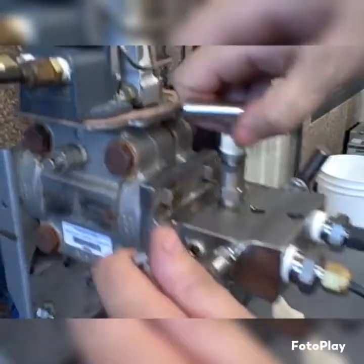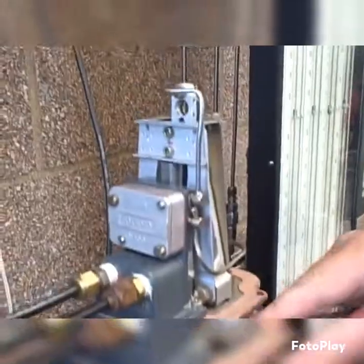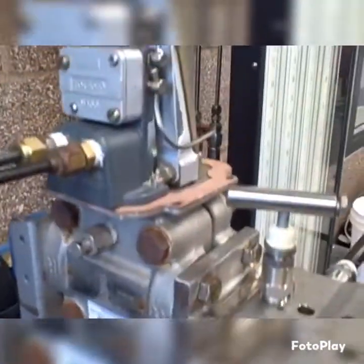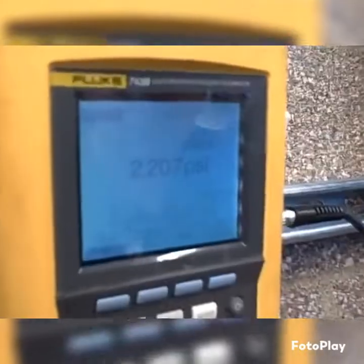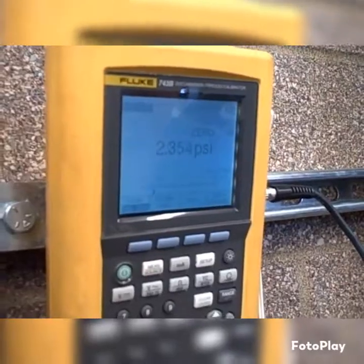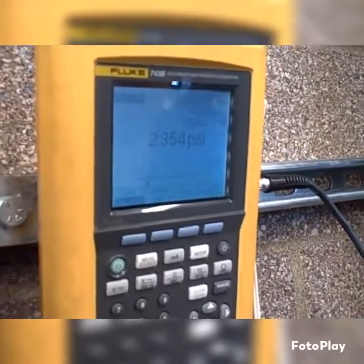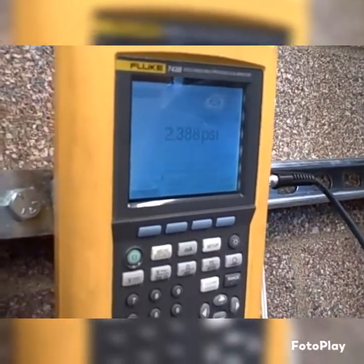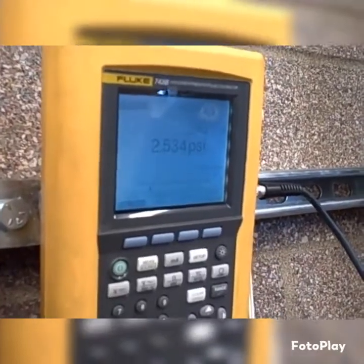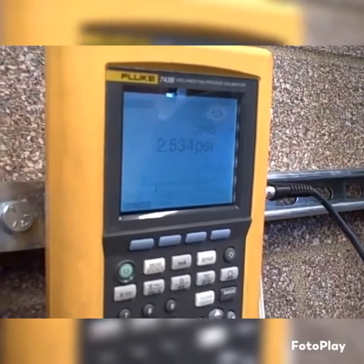You can audibly tell that there's a pressure change — it isn't hissing quite as much as it was before; it's not having to counterbalance as much force. We are sitting at 2.2 psi, supposed to be at 3. So we're doing the coarse adjustments. My recommendation is that you don't try to nail it exactly on each end — it's just going to mess it up. Get it approximately at 15 at the high end, approximately at 3 at the bottom end, go back and forth, then take lots of time to get it dialed in.